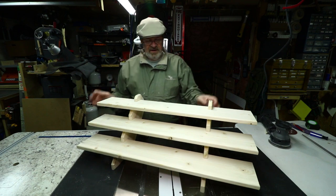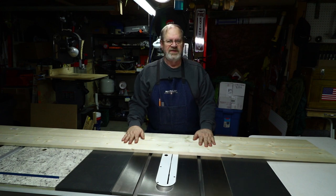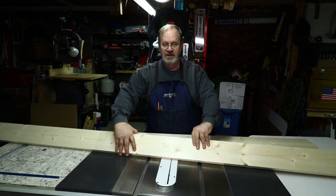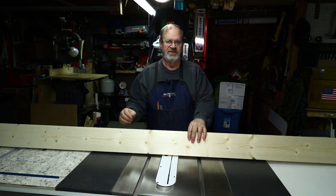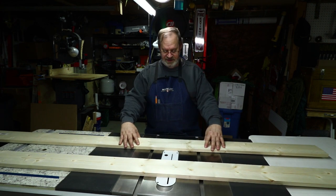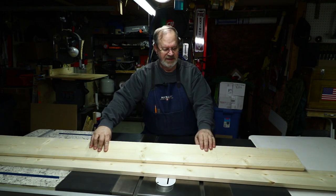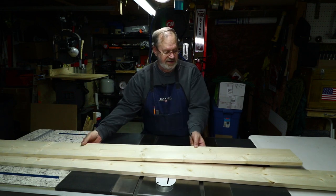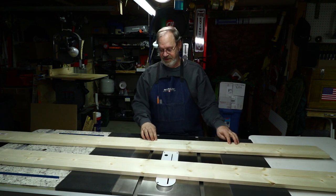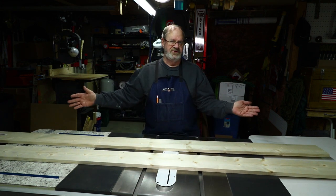Stay tuned and I'm going to show you how I make these. I have two boards here. They're 1 by 6 by 8 foot long and it's a better pine board. This first one I'm just going to cut into three pieces, which will each be 32 inches long — the width of the shelf. The second board I'm going to cut out my patterns that I've laid out on here. I'll make the major cuts to get these pieces out and then finesse them further on my table saw and band saw. I'm only using about half of this board. If you added one more 8-foot piece, with the leftover you can make two shelves.